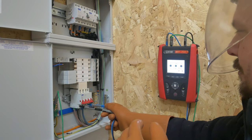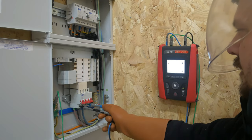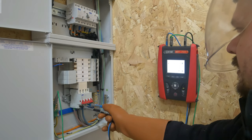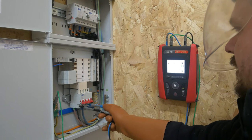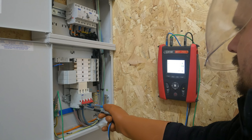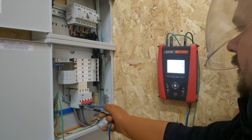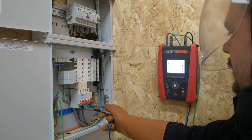Right, so we'll get into the RCD test now. I've got a helper at the other end to help reset. I'm going to hit the test button. First up it runs through the ramp test — and it should go out, so it's done that. We're going to restore the power now, and then it will go on to the 180-degree phase. You can see it's taken that out at 16 and a half milliamps — that's slightly on the lower side. We'll carry on with the test. We're now into the 1× tests: 29 milliseconds — next one: 17 — again: 7 — again: 13 — and now we've got our half-times for the last test. And these should measure off scale because it's only half times. And there we have it: we've got an RCD that's working.